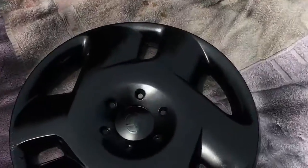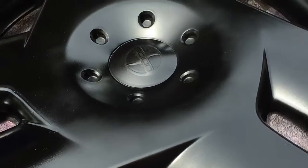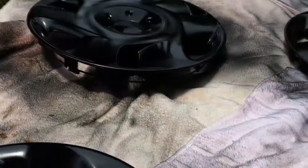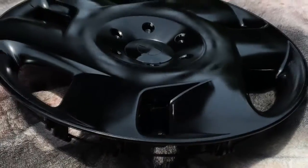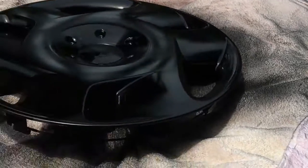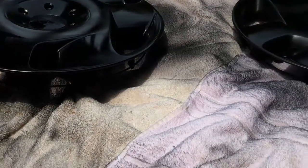This is two coats and it's looking pretty good. I've been putting it on pretty thick — if you've heard of orange peeling, that's when you lay it on too thick and get a weird texture. It's also not mirror-shiny yet even though it says gloss, and that's totally fine. We're going to put on another one or two coats of black, let that cure for a good 24 hours, then switch to clear coat, sand it, and buff that crystal shine out.